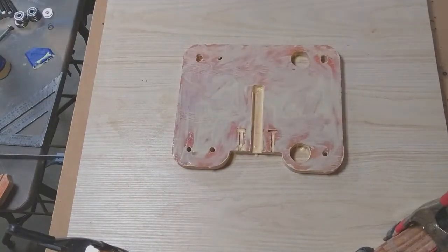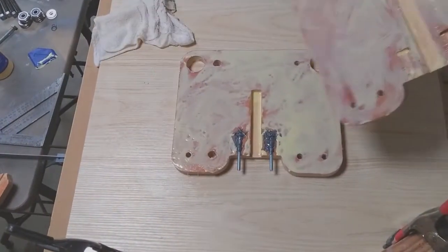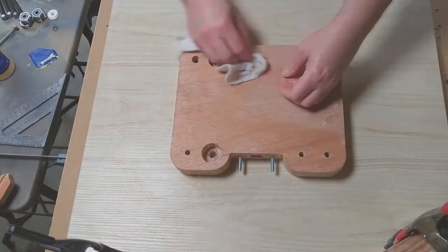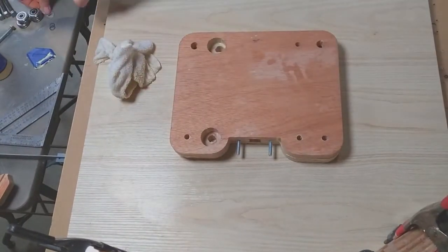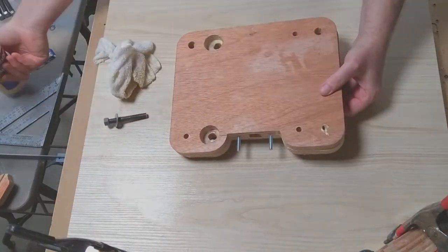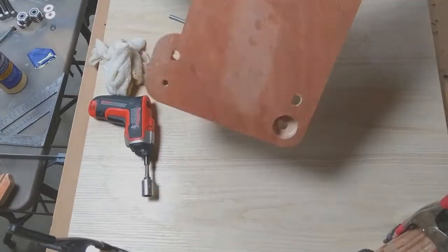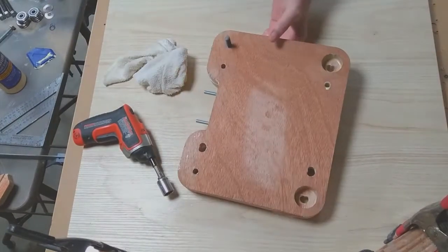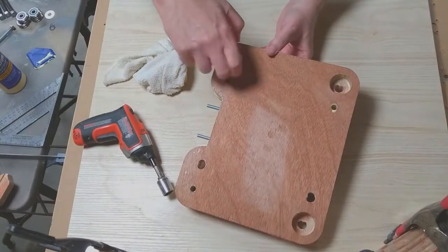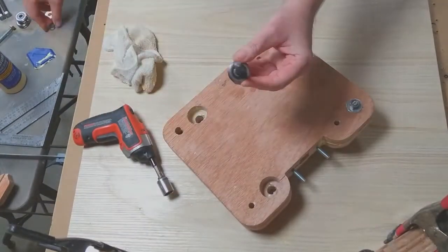More smearing the glue around. Part of the clamping is I'm going to use some of the V-bearing bolts going through those holes, which will pull the pieces together and also align them perfectly. I'm using a fine thread 3/8" rod here with nuts loctited in because I had the threaded rod laying around and didn't have to go out and buy any 3/8" bolts.